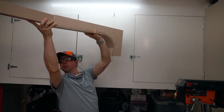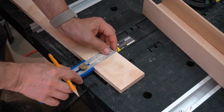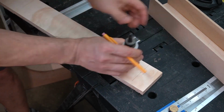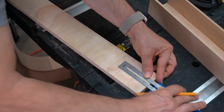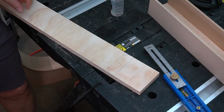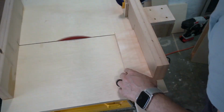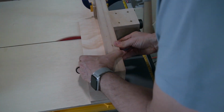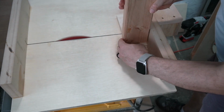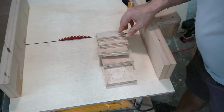The mistake that I made in building the extension arm hadn't quite dawned on me yet, so I started working on the hinge pieces that I was going to use to attach everything to the wall out of 1/2 inch plywood. Another great technique for maintaining accuracy in your measurements without using a tape measure is to use a stop block to keep everything exactly the same length. That's how I accomplished making these identical hinge pieces.